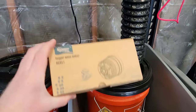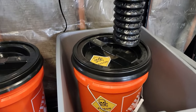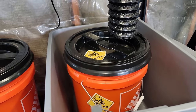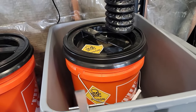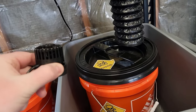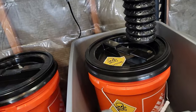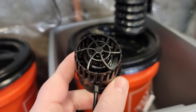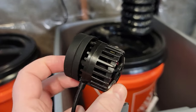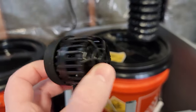It's a wave generator instead of an aquarium pump. I didn't want to blow bubbles into the acid bath because I didn't want a lot of fumes floating around the shop. This wave generator is basically just a motor on an impeller that circulates the water. It worked well in my testing with distilled water. This version has a plastic impeller and supposedly a ceramic shaft that is corrosion resistant, so hopefully it will work in the acid without dissolving.